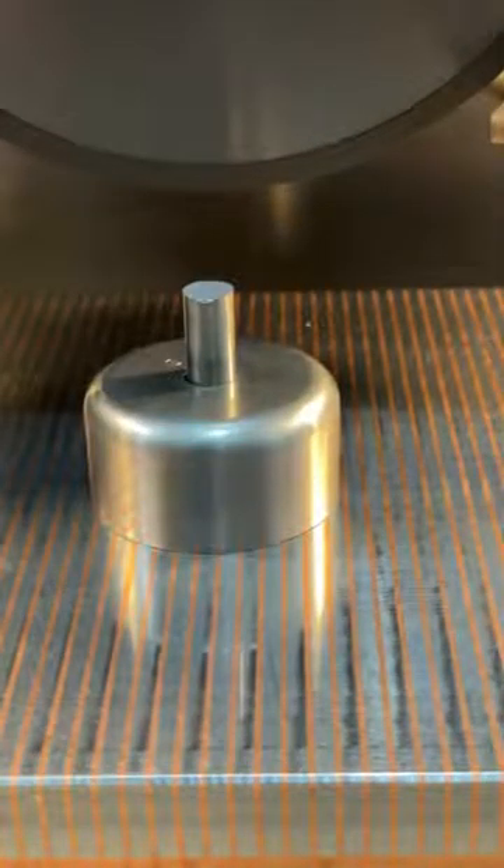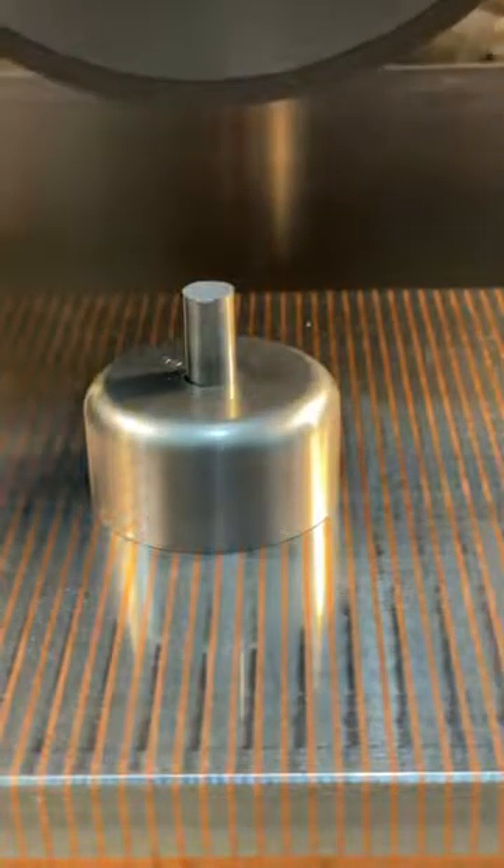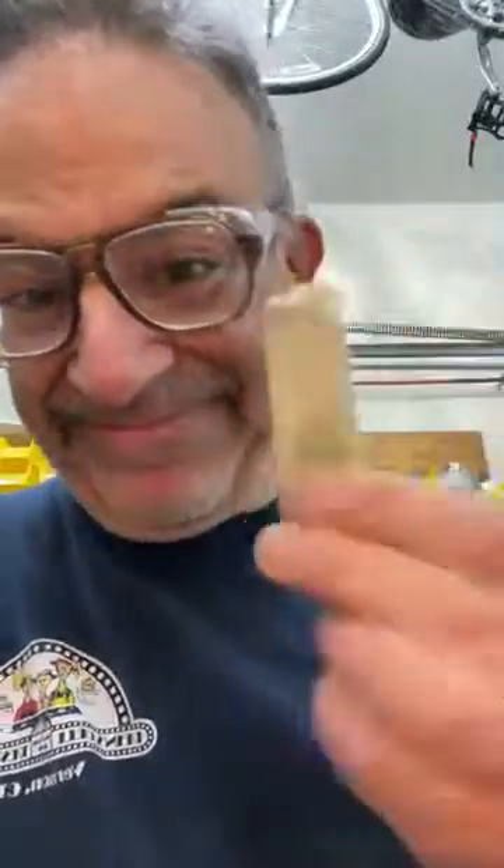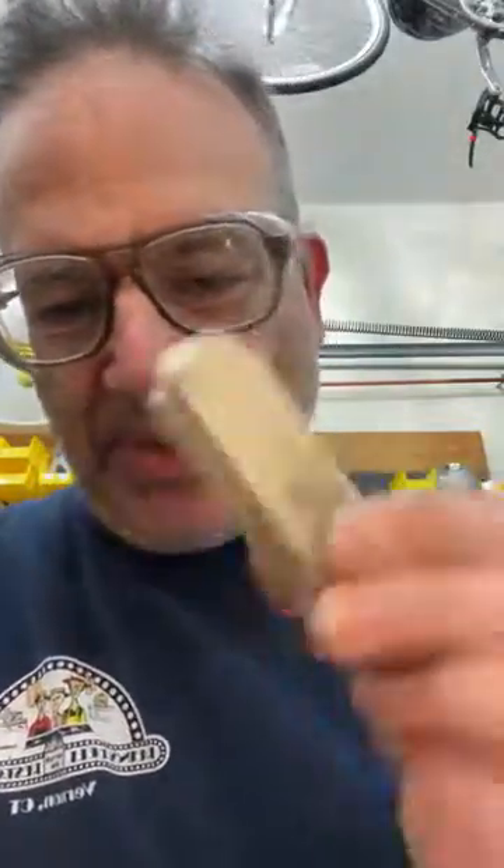So that's it — we're done. This wheel is balanced, this wheel is dressed. There's one last thing to do here. Normally, if we're about to grind carbide, we would then go in with a dressing stick to dress down the bonding material — the matrix — leaving the diamonds protruding more. We don't have to do that because I'm about to grind a whole bunch of PFG stones, and you know what they're made out of. But normally, if I was about to do carbide or something, I would hit it with a dressing stick.